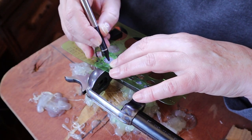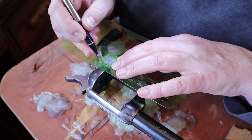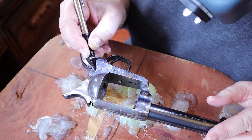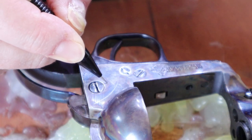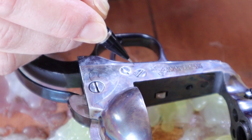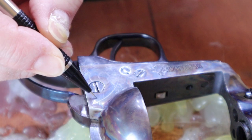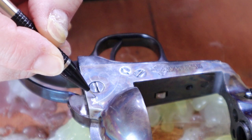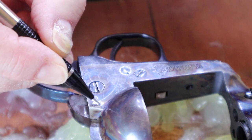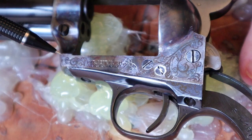I'm getting started with the left side of the frame. I start drawing — I put my white paint on and then use the circle template. The circles will be where the scroll will swirl. Getting the swirl of the scroll is the important part. It consistently reduces on itself — a mathematical thing we find in nature that happens perfectly.